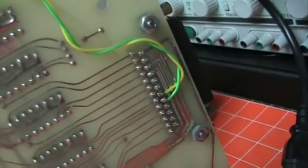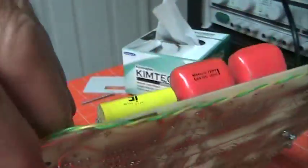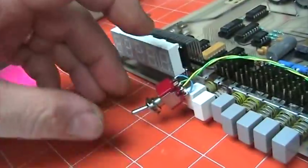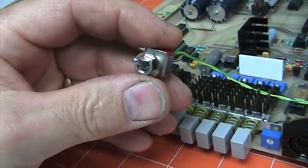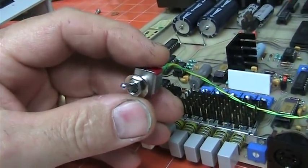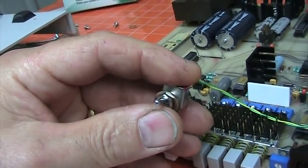I didn't want to have to mess with that, so I connected wires onto those two pins, tacked them down to the board, brought them up to the switch. Initially I had a regular switch to switch in pins 18 and 19, and then a normally closed push button.